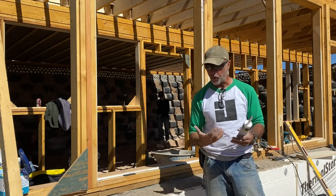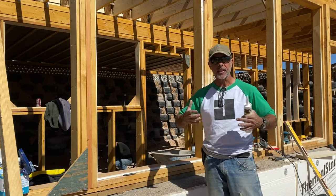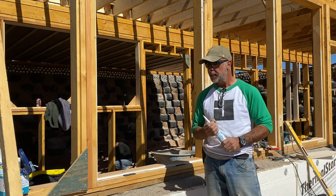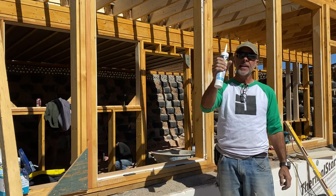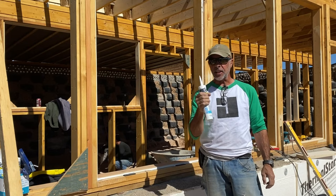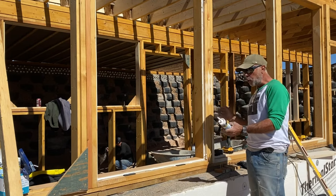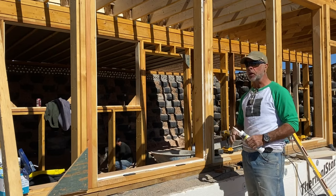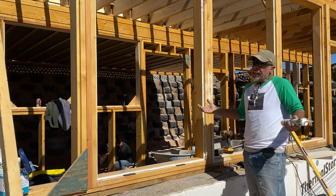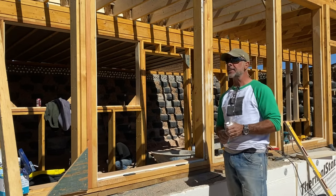Again, as I keep saying over and over again, we want the wood to be able to move and breathe and flex and expand and contract. All of that's extremely important around this rigid piece of glass. So this acrylic latex is actually an excellent product, even as affordable as it is. It's designed to flex, allowing the glass and the wood to kind of move. If you go with silicone, it will not do that. It will hold the glass against the wood. And then if you ever break the window or it fogs out after 10 years, hopefully not less than that.